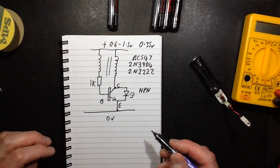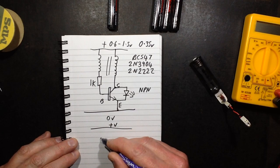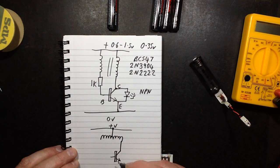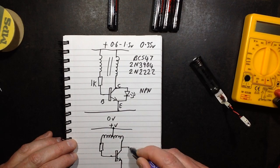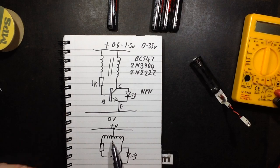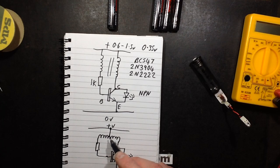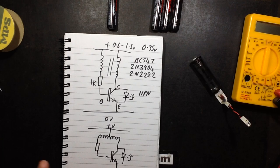Another way this circuit can be drawn is with a centre-tap transformer. You can actually use a small centre-tap transformer — although if you use a chunky transformer, you might have to beef up the transistor to drive it. It's the same circuit arrangement, just in a more visual form. If you use a small mains voltage transformer with a secondary that has two 3-volt windings centre-tapped, you can actually use it in this circuit and it will drive quite a high voltage output. It's a neat little circuit — you can do unusual things with it.